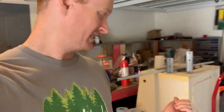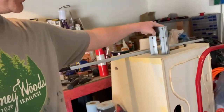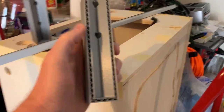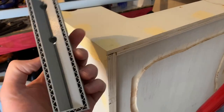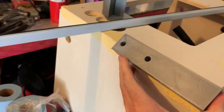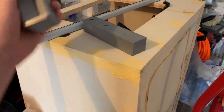I did 3D print these handy dandy jigs here to help you put the leg holes in right. There are two different sizes - the front is the big one and the back is the small one. The shorter ones go in the back. The print failed a little but it's good enough. It's a 3/8 inch hole - it's got a flat part at the bottom and it's angled, so you just stick it on there, slide it up, and it gives you a perfect 45-degree drill angle.